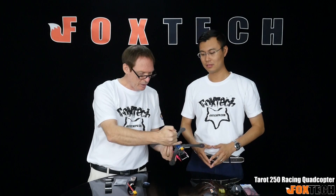Now let's talk about where we're going to mount those ESCs. The ESCs are here, and you have a very good heat distribution point. This aluminum will not only secure the foot very well — three screws through here — but it also helps to dissipate heat, because you don't want the ESC too hot. It also helps with wire routing — less wires. The wires come through here and solder into the PCB, running down through to your other ESCs and motors. That way, you have less wire mess.